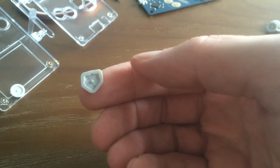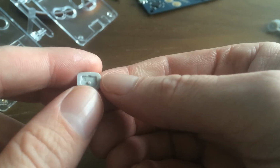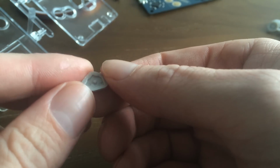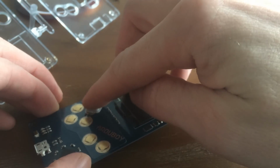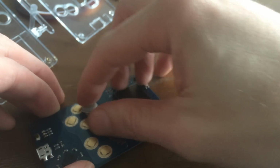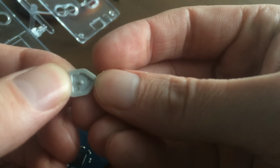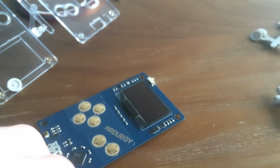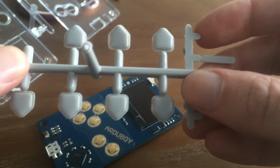So you can see here, these are the little underside. The little pin that's in the middle is the actuator for the snap dome. So that's actually what is pushing down here. So the idea is that it's sitting here and gets a nice little activation. The 3 little divots that are in there are actually ejector pin marks. So that's where in the mold it ejects the part. And this is again called the family mold, so we're producing multiple units at the same time.